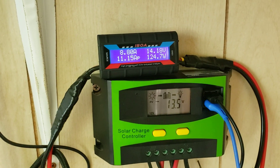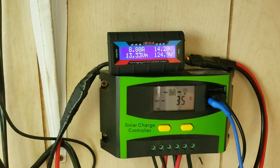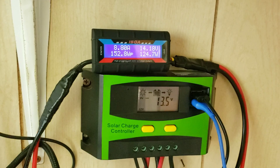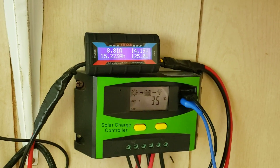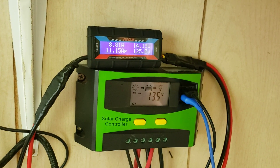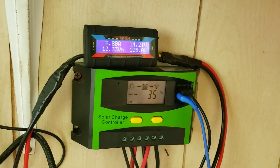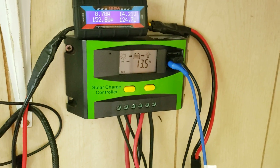We're only pulling down about 124 watts because the sun is setting. The numbers are a little skewed because the batteries were fully charged — the charge controller clicks off at about 14.5 volts, so it won't capture the power coming through anymore once the charge controller protects the batteries. Right now we're pulling around 8 amps into the battery and it does very well.